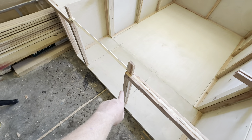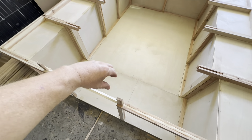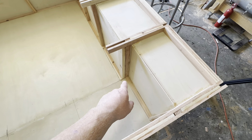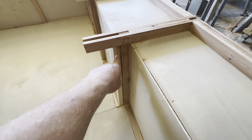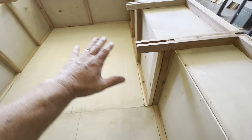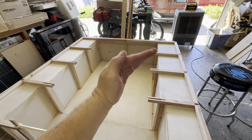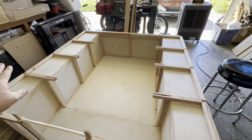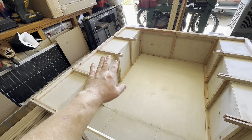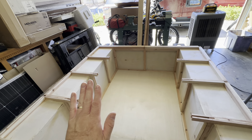I did the same thing here — this will be the door opening. I roughed it in now but will define the overall height later, then I'll just laminate pieces, slide over this, glue it, and clamp it together and pull tight. When I flip this up, you'll see that this column structure drives right into the frame structure, which is covered up with plywood in the bottom of the floor of this tub. From a joinery perspective, on the east-west or side-to-side plane, everything is tied together through these mortise-and-tenon-like joints. Front-to-back, I just have various pieces inserted and they're glued and screwed — no traditional joinery holding it from the front-to-back angle, but I'm not worried about it from a strength perspective.